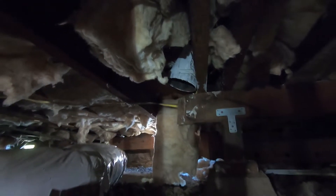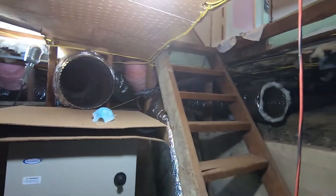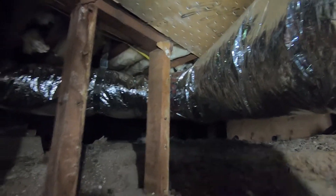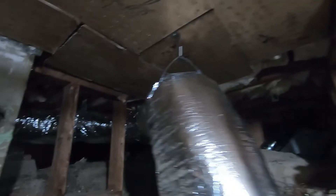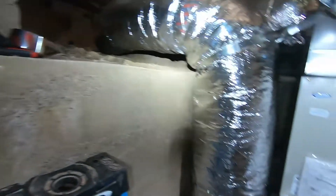Now we're connecting the supply for the breakfast nook — there's the duct, the elbow, and the metal strap, connecting right in front of the evaporator coil. It's all connected now, and there's a tee back there for a future duct that will connect to the kitchen, capped for now. So the layout is: 12-inch supply on the left, 14-inch supply on the back of the supply plenum, 9-inch supply in the front. On the right return plenum there will be two 12-inch return ducts, and on the left return plenum one 16-inch return duct.